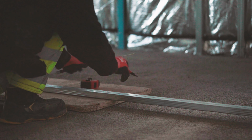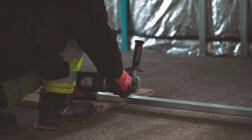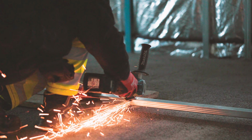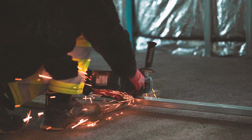In January, we wanted to start preparing the plasterboard frames on the ceiling and finish installing frames which we had skipped earlier to speed up more important work. Previously, we started to install frames on the walls that are in contact with the floor, because without ready-made plasterboard frames in these places, we wouldn't be able to put the screed that you've just seen.